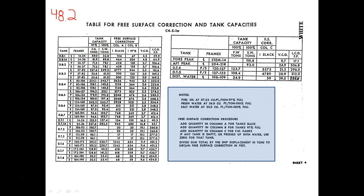If it's 48.2 tons, I'm at 97% capacity. I now come over and use these two columns to extract my I value. I is the free surface constant — it's also the moment for that tank if it's slack. It turns out that 48.2 was 97%, so I'm going to take the I value for 97%. If I had 48.2 tons in DB1, my I value — my moment of inertia for that slack tank, my free surface constant — would be 67, and that is in foot-tons.